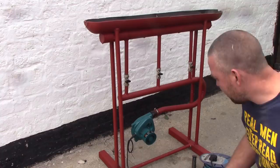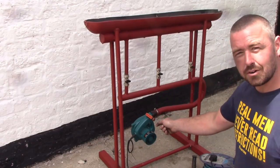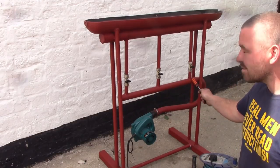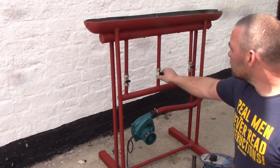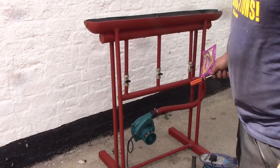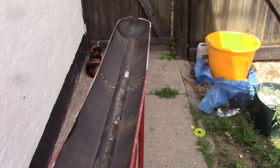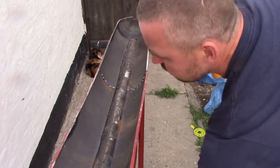The completed long forge. The stand went on, I gave it a coat of red oxide paint. We've got the blower off my other forge, so I'll switch and change between them — it's cheap, I might get another one, they're only like ten quid or something. It feeds air along this larger diameter pipe, then up into the three individual sections through these routes, so we can switch off the middle or one end. Into the trough at the top — that all came out very nicely. Obviously I still don't know if it's going to work, and I expect the success of this will be down to my control of the fire, as it always is with coal. But I'll just demonstrate shutting off each end.